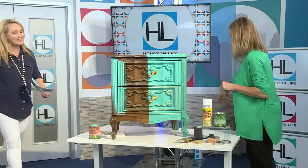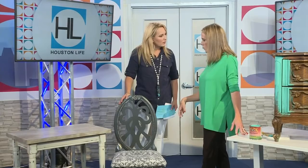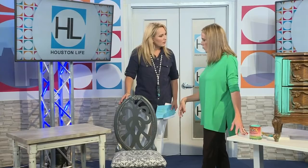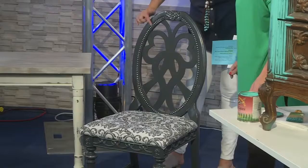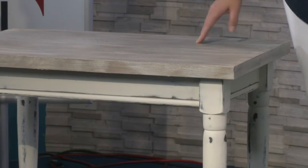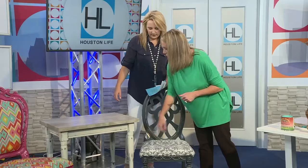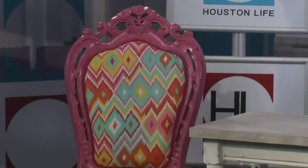Let's look at some finished pieces to show what furniture paint can do. This one before was just white — we took it and made it gray, then used the guilders paste to accent those raised edges. Over here, I painted the top of this one and used a heavier distress on the bottom — using a sander or sanding block to break it down and get down to the wood. If you have really pretty wood underneath, you want to expose some of it rather than leaving it solid paint. Then you can distress it with sandpaper for that look. And I love that pop of pink on that other piece — paint and recover the fabric and you've got a brand new chair.